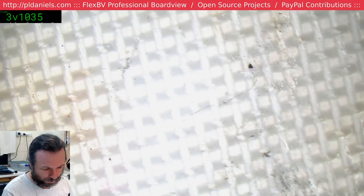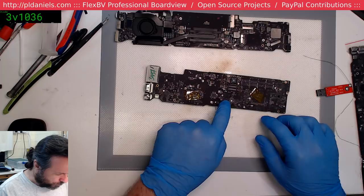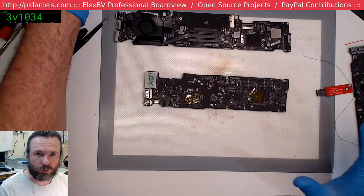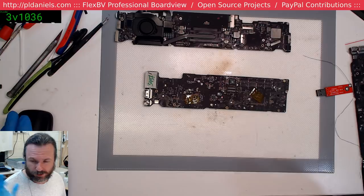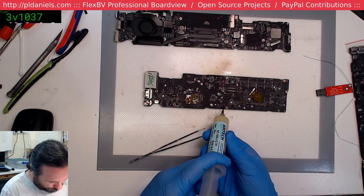Now what I'm curious about is maybe if I put that BIOS back on, or better yet, okay, let's go around in circles more. We'll take this BIOS here, it's the same size, we will flash it with the original BIOS that we got off the broken one. And then we'll put it onto the board and see if it does the same sort of thing. I know it's a lot of stuffing around, but we're just sort of trying to eliminate things here.